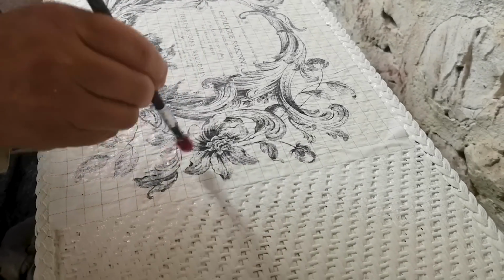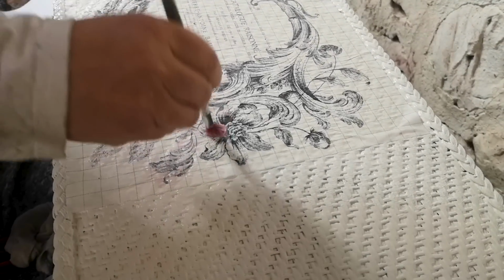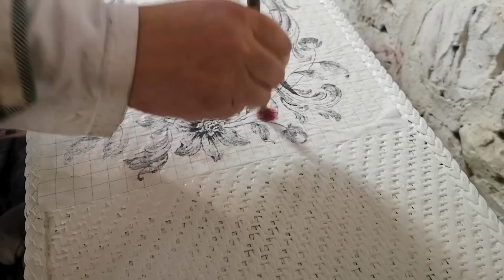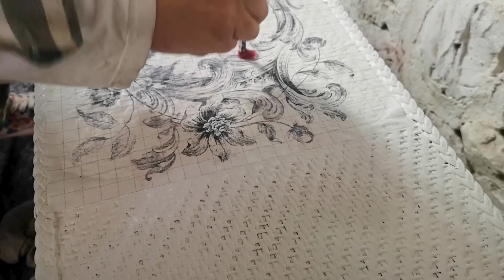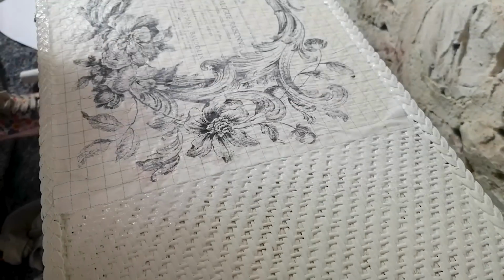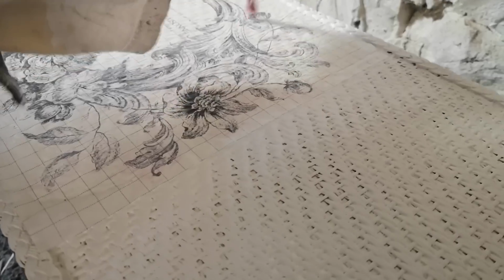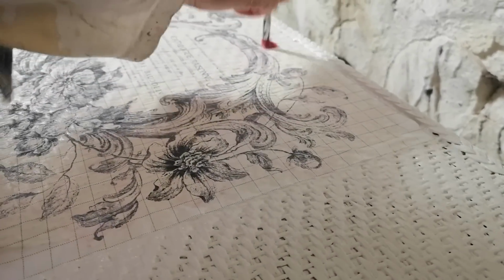Now, when you apply inlays, they're live underneath this. You have to really treat them carefully because it's chalk paint. It's a chalk-based paint underneath here, which is live and unsealed. So as soon as you start kind of messing around with it, you can smudge it. So we are going to have to spray this piece. Even before I put maybe some dark wax and things on it, I'm going to have to spray seal it. The top is a different kettle of fish. I'm still going to spray that actually, but now I'm just kind of pushing it down.